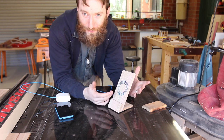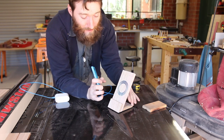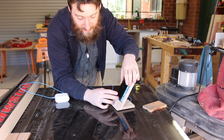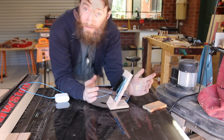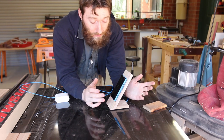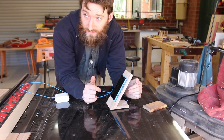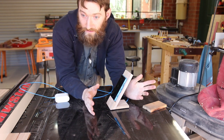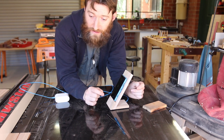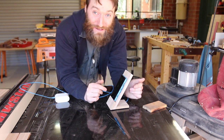I will be making another one of these now that I've worked out the issues with two-sided machining, which is mostly the dowel sizing. If I make another one there are a few enhancements I might make — perhaps scalloping it out a little so the phone has something positive to register into, but to be honest it works pretty well just like that. This isn't the only way to do two-sided machining — there are other ways using larger tabs as you'd normally have in an Easel project — but this way works well provided you've got the right size dowels. I'd almost be interested in getting some plastic dowels just so I know they are the size they say they are. Let me know in the comments if you want to see more two-sided machining videos, or whether I should stick to projects that are apparently a bit more within the scope of my brain. Thanks for watching.